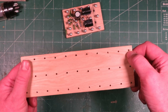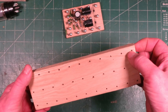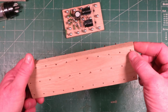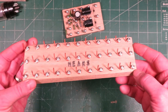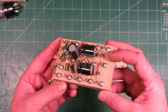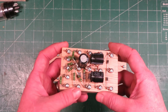I drill three thirty-seconds inch holes, which helps make sure the wood doesn't split. I found that hole size is pretty particular — any smaller and the wood would be prone to splitting, but three thirty-seconds is perfect for a number six three-eighths screw with the round head on top. Here's a closer look at the power supply — you can see the diodes right there, making up the full bridge rectifier, and the power supply filter caps.